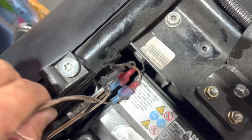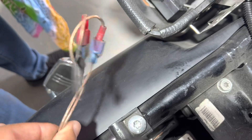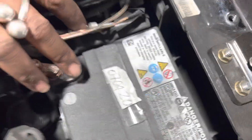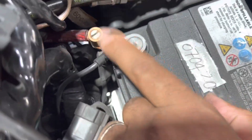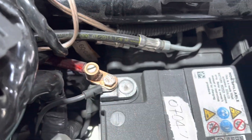There's their version of making it serviceable with some dollar store wire and some cheap disconnects. Nothing's protected — it's just laying on the battery. I would have liked to see fully insulated connectors on the battery. That is the negative and it's got a red wire on it, which is going to cause some confusion.